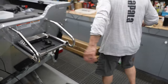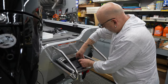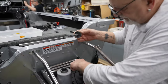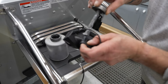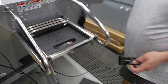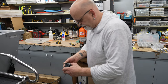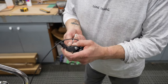Now we put our nut and bolt together. Never fails - every time I use stainless it likes to seize. So we use this gray anti-seize stuff, because it seems like every time I turn the bolt in two turns they seize. This prevents that. Don't get it on your clothes because you'll never get it off, as evidenced by some of my shirts that still have gray stains.